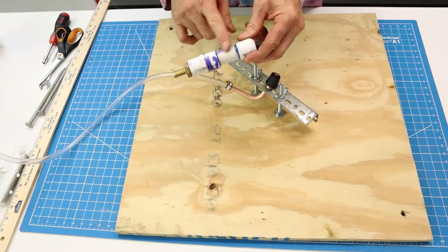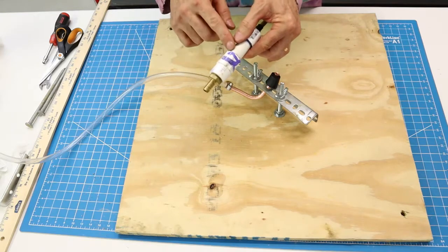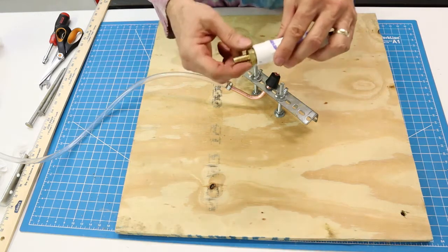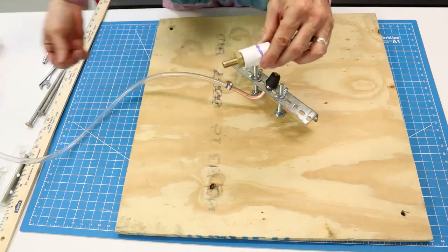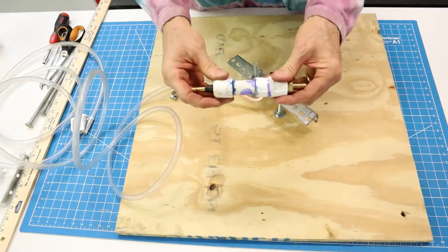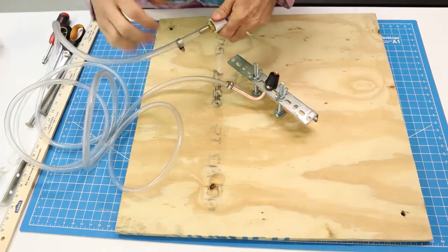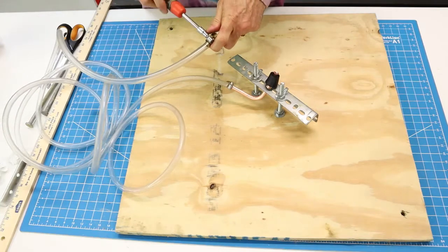There's a piece of half-inch PVC pipe, an adapter from the plastic to a threaded end, and a three-eighths inch flared pipe end on a brass fitting that sticks into the other end of the hose. Purple stuff is a primer and the blue is the glue — once you seal this thing it's airtight. Then we're going to tighten the hose clamp.